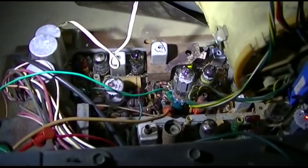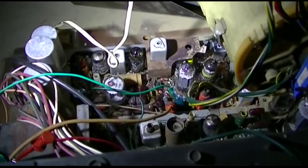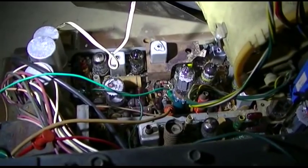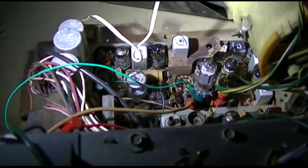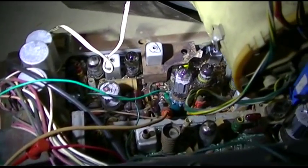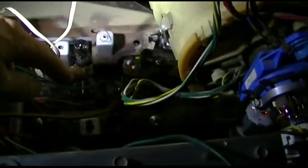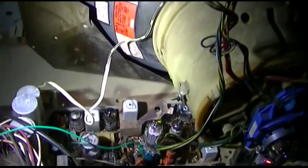Guy right here, and I am still getting the pulses, but they're not as exacerbated, and I don't think it's the resistor. I think it's the voltage, the B+. I'm starting to think it's a voltage. What I did is I measured the voltage on that VDR, and then I used my decade box to substitute a value in.